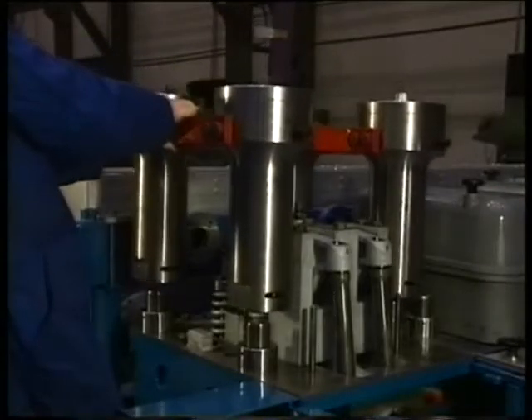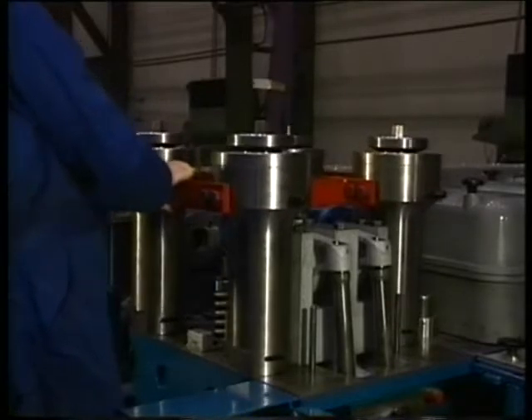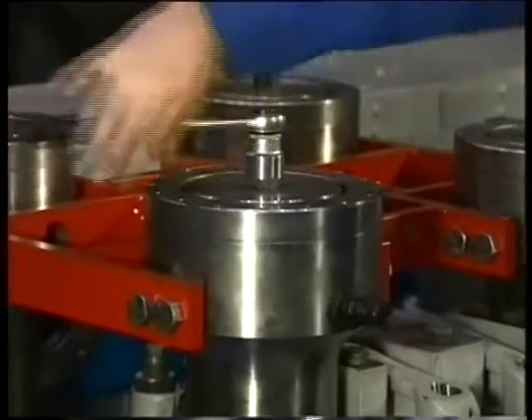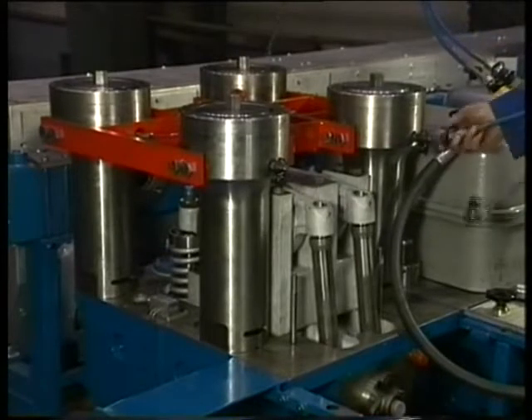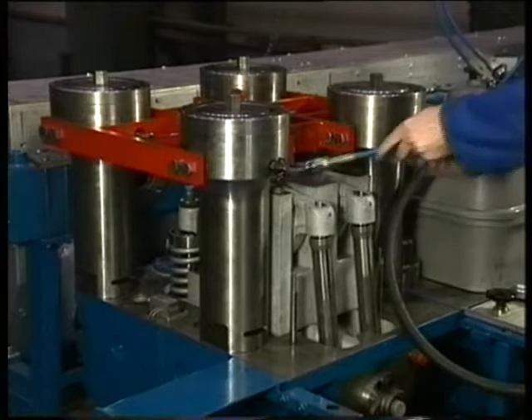Fit the hydraulic stretching tools again. Then tighten the jacks completely and connect the hoses. The return valve on the pump should be opened. After that it is necessary to check if the jacks can be turned any further. This is to be absolutely sure that the jacks are in bottom position and that there is a maximum stroke available.